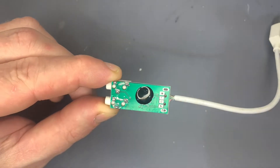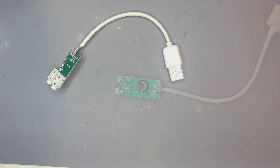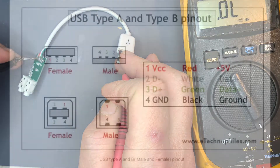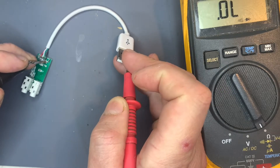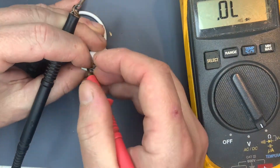It's got a blob IC — the cable leads straight into it, so if there's something faulty under there there's not much we can do about it. The chip resistors on top are for the audio side of things. So all we can do is check the USB connections. The outer pins on the USB are 5 volts and ground; the middle two are data. Don't worry so much about the orientation of the data pins — they can be swapped if they're wrong — but you don't want to reverse the voltage pins. Keep in mind not all USB cables will have red and black for voltage; I've seen at least one that was wired randomly, so be careful and always check.